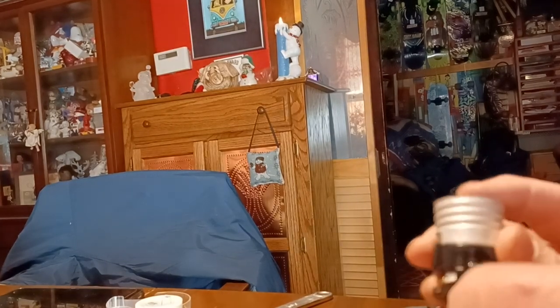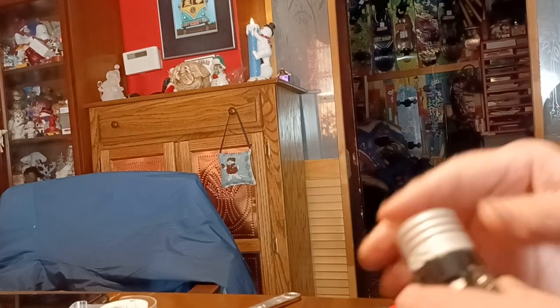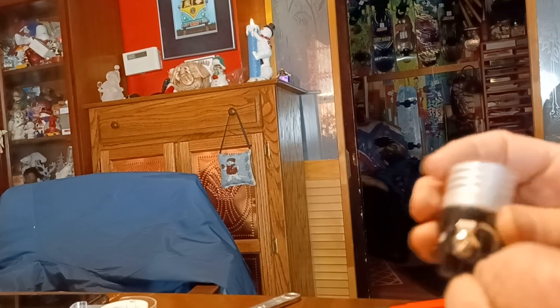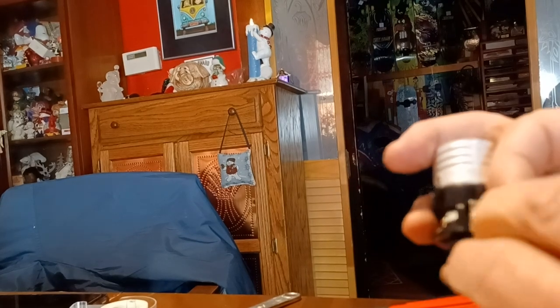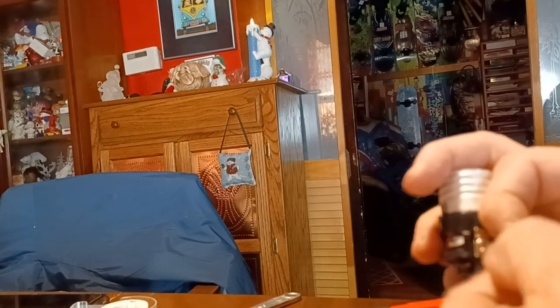Now when you put these wires on, don't put them on the other way because that will make the wire spread and separate. You want to have that hook going in the direction — like that. If you put it on wrong, when you tighten it, the screw will actually unfray the wires and you'll end up with a mess. We want this to be nice and tight. So we'll just go ahead and hook that on again so that when you're looking at it, it looks really nice and neat.